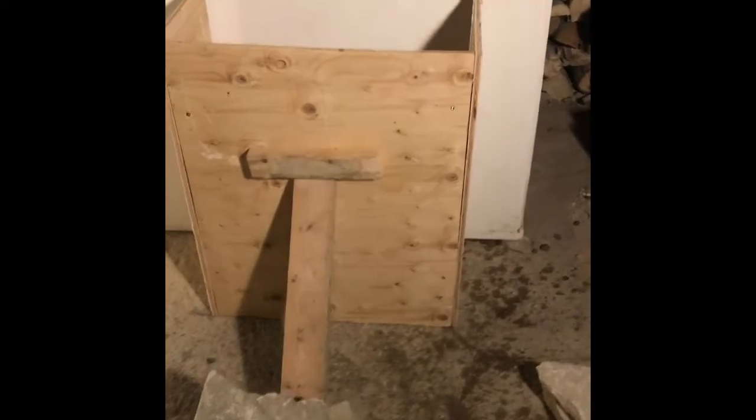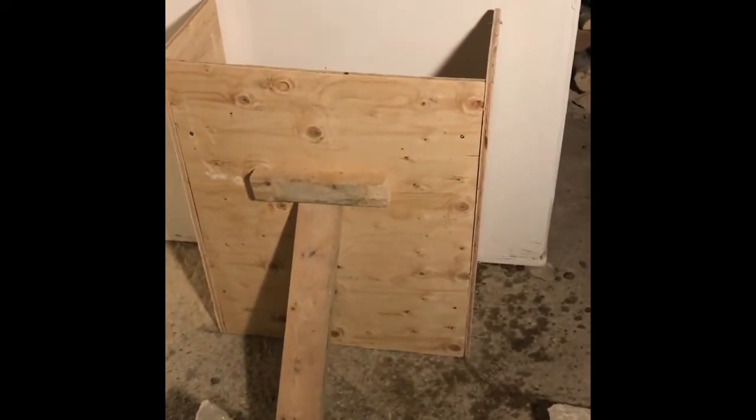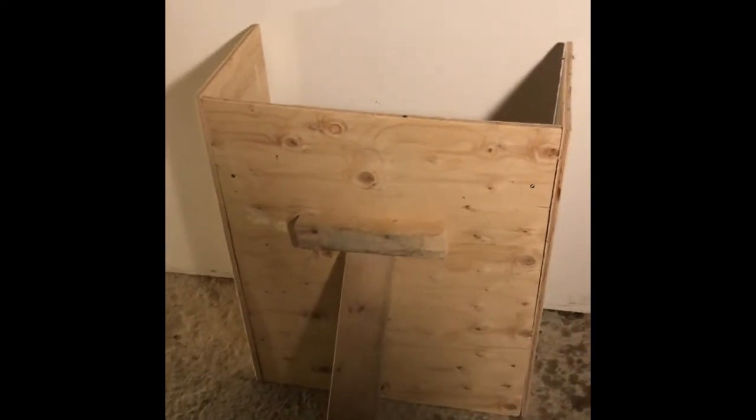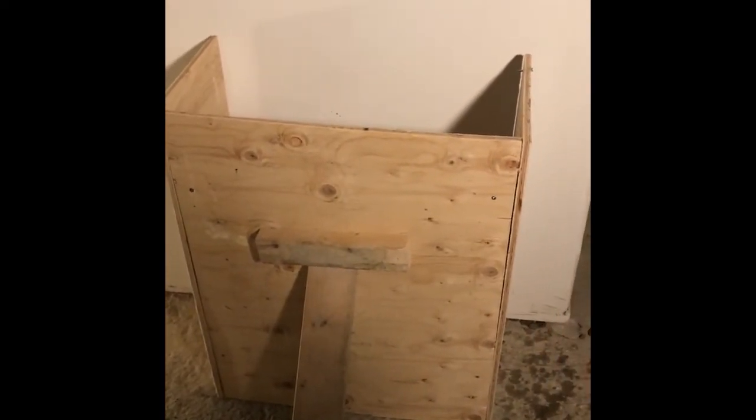For the next part, I'll be building the structural mass — the free-draining structural mass — out of hearting material, bigger pieces of stone. I'll probably go up to about the top of the brace, and then we'll pull the box away and see what happens. I have it all hearted here. You can see just with bigger pieces, all hand-placed, it's sitting pretty good.